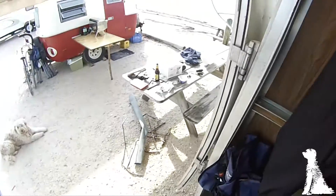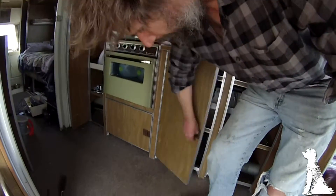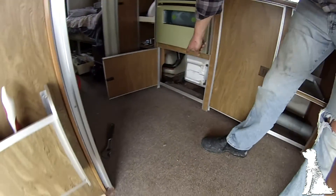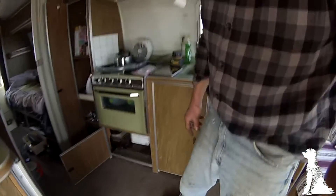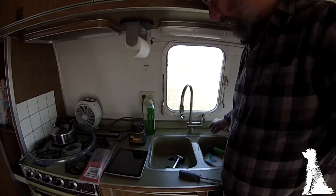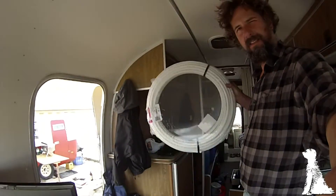I was going to rip out all the plumbing today, and if you look outside you'll see all that nasty old copper — that's what the trailer was plumbed with, as all the old trailers were. I've ripped it all out all the way through underneath, around the hot water heater, into the next locker there. The hot water heater is actually relatively new. Those two copper lines are still heading back for the old shower which I'm going to abandon and pull out. I also changed the tap to a nice new one — had a nasty old leaking miserable tap on there. I'm going to redo it all in PEX plumbing. For those of you not familiar with it, PEX is just plastic tubing basically, and it's very easy to work with — it'll make a much neater job of redoing the plumbing.